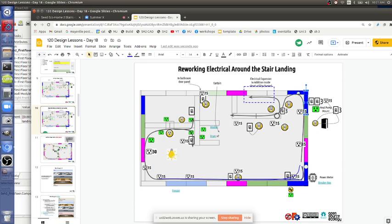There is an outlet in this one. These ones were actually switches. This is more - I think this was in this wall here - because you want to have a switch for a light at the bottom and top of the stairs. I got so many of those switches - they might have been for lights here or some other lights. But this one - three-way - that three stands for a three-way switch, which would be for bottom and top of the stairway.